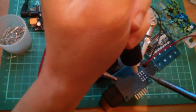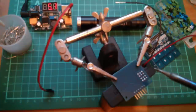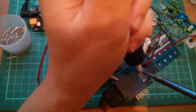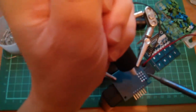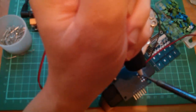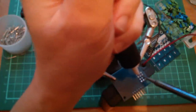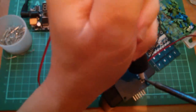Solder sucking plated through holes is extremely difficult. I knew this was going to be a real challenge. But with any luck, and sometimes when the hole is half empty, you have to actually refill it with solder in order that you can get the solder back out. Yes, I am having a battle royal.